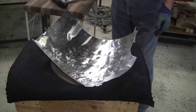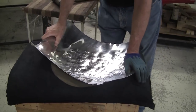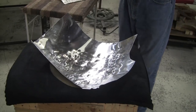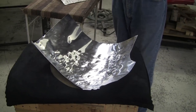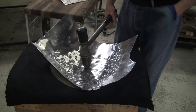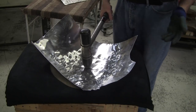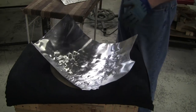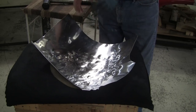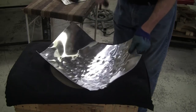It's better to have your hammer blows accumulate rather than hit it really super hard. If you use too sharp a point and you really whale on it like this, you'll be doing molecular damage to the panel. Sometimes it's a survivable problem, but that's not a good thing to do. It's better to just do it in stages — slowly bring your panel out, let the blows accumulate.